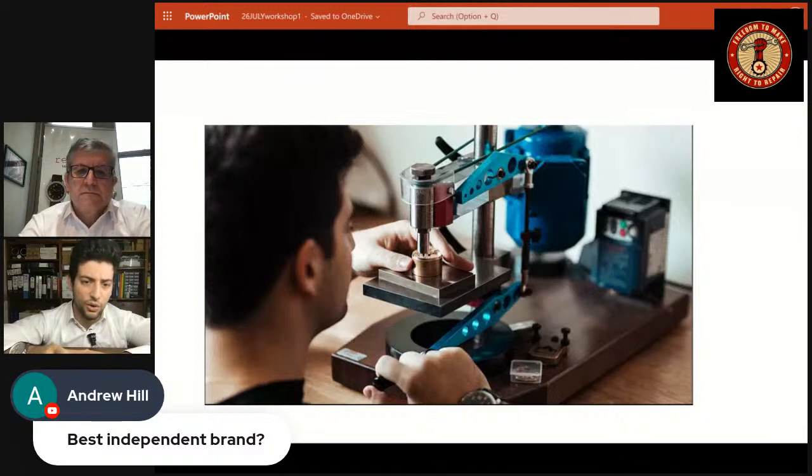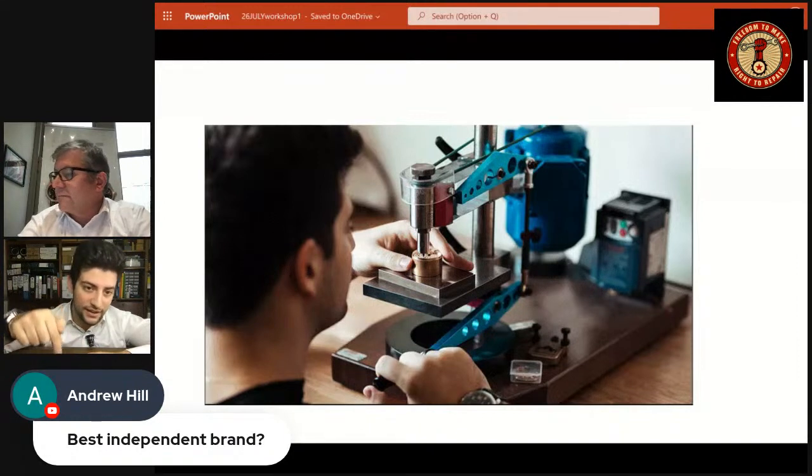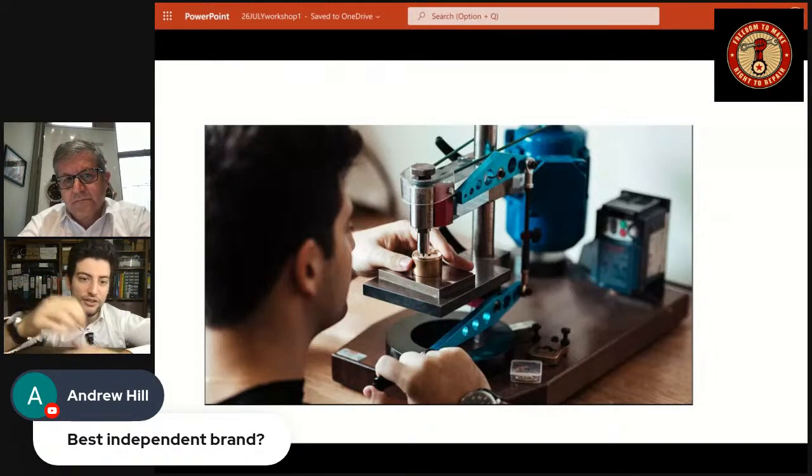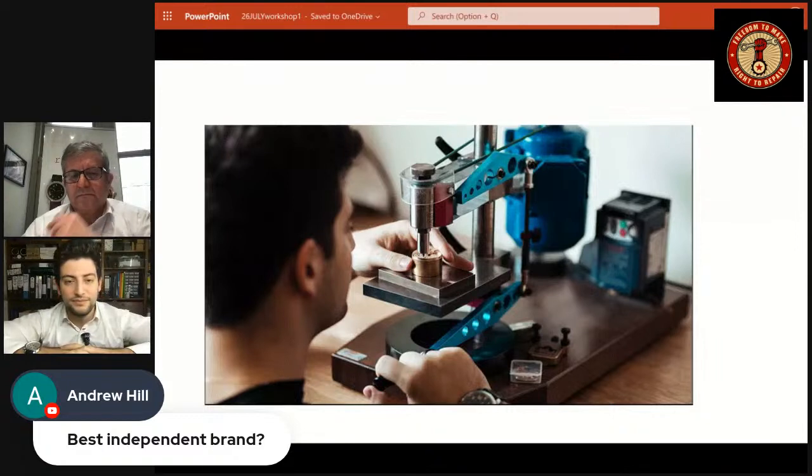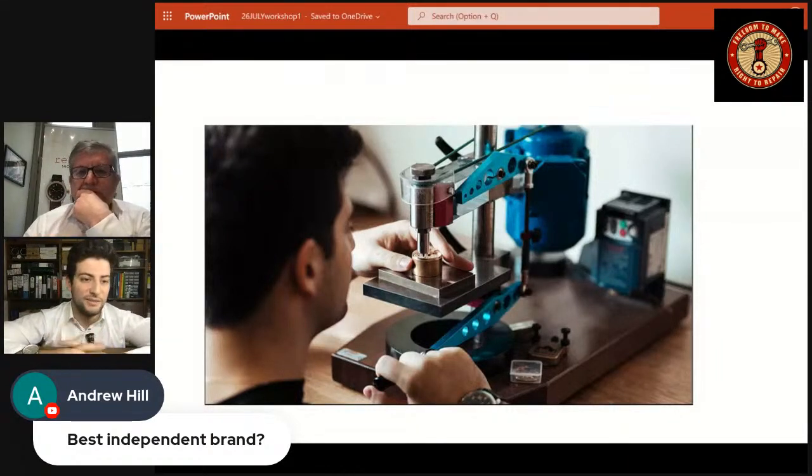To apply the perlage finish, you basically just pull down on that lever, the rotating bit comes down, and it grinds a circular mark into the brass main plate or the steel component you're applying the perlage to. This would be done before plating, because if it was already gold plated, you'd scratch all that gold off and reveal the brass underneath. That's basically perlage, I suppose, in a couple of sentences.